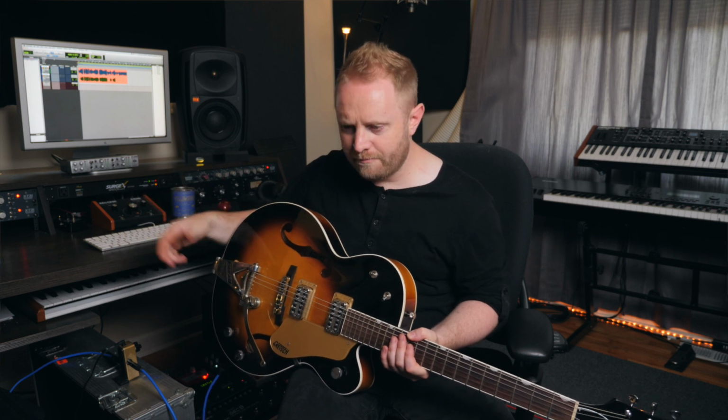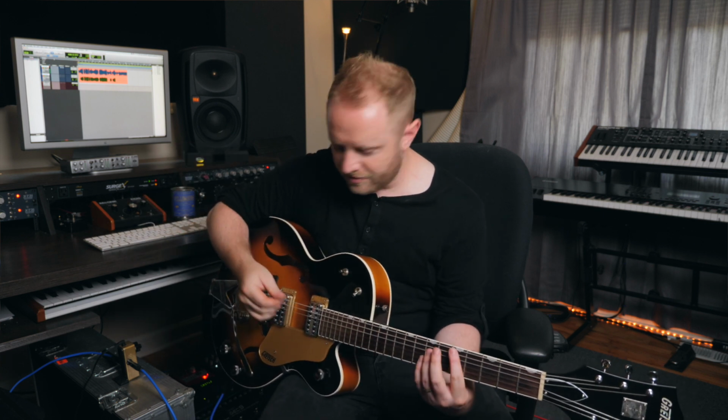A lot of times people like the bass cut on a normal KLON because it allows you to have more drive and more level going into your amp without your amp sort of farting out in the lower frequencies. If you have pushed a really low frequency boosted pedal into an amp before, you've heard the speaker go crazy and it can't handle it. And so it's like a really smart overdrive pedal. And it's great for, like I said, stacking. It's great for just a little boost on your signal, if you're just playing chords, which is what I do most of the time.